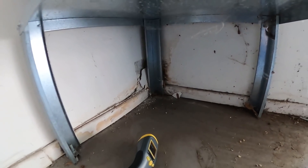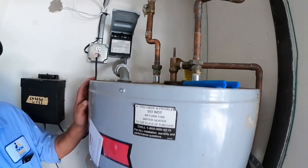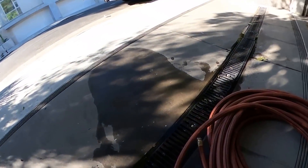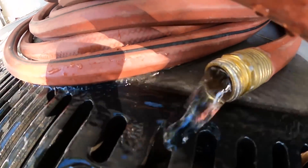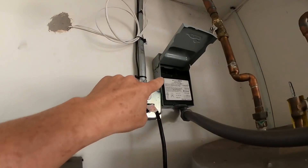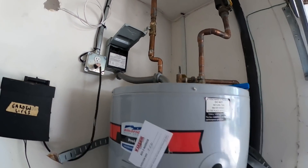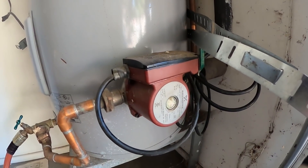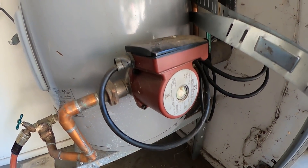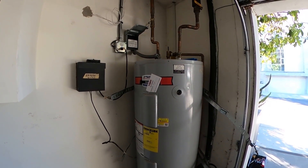We're going to open up the relief valve and get some air so we can get a much faster drain of the water heater. You can see we're utilizing the drain here — we're flowing pretty good. It's probably going to take about 20 minutes. The first thing you want to do is shut the power off to the electrical system. And if there's a recirculating pump, you definitely want to disconnect that. A lot of people will burn those pumps out by not unplugging it. Those are two key points you really need to know when draining a water heater.